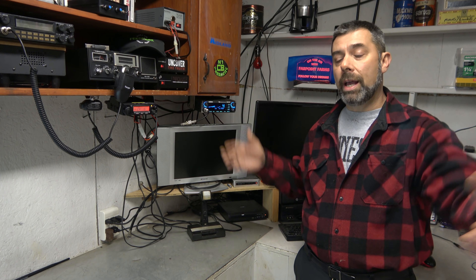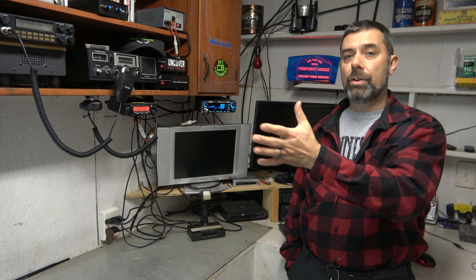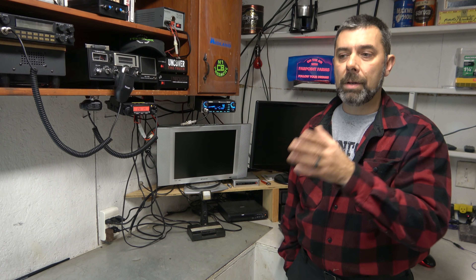There are companies that make beam and quad antennas — stacked beams where you use multiple antennas to get massive gain, requiring a rotor to point them. We talked about that in part three. But there are guys and gals out there who build their own base antennas that complicated. That involves using aluminum or steel conduit, being mindful of the weight. I know a guy back in Raleigh who built a three-element horizontal beam out of steel electrical conduit, cut it to the right sizes, attached it together, put it on a TV antenna rotor, and put it up on his tower.